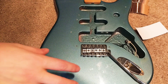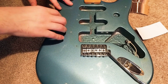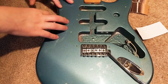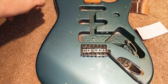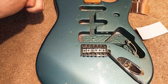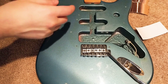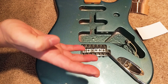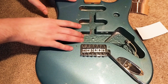Today we're going to do shielding the inside of your guitar to prevent the hum and radio interference that happens when you're using single coil pickups. You're never going to cut it out completely unless you get noiseless pickups, which are basically humbuckers. In some cases people have vintage style pickups where the middle one isn't wound in reverse, so every position hums — but you can cut that down dramatically.